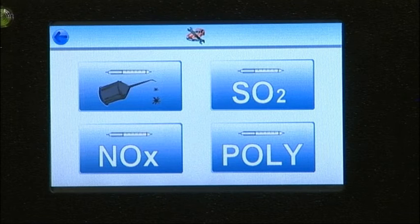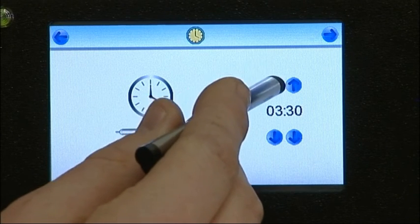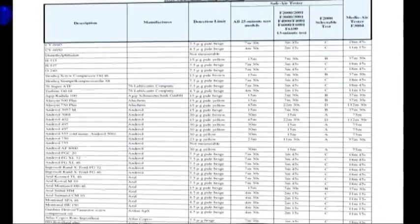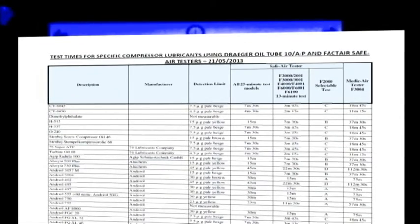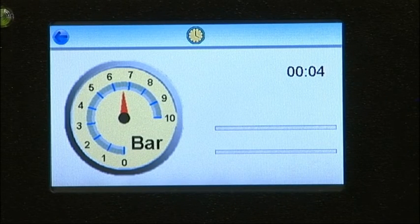If you're intending to complete an Oil Tube Test, you'll need to input the test time. If you can determine with a high degree of certainty the specific compressor lubricant being used, refer to the Test Times chart on Factair's website for the F6100. If you have no knowledge of the type of compressor lubricant being used, Factair recommends a 15-minute test as this covers the vast majority of lubricants. Once you've selected which tube you wish to test, the instrument will complete a 1-minute purge sequence, during which time an airflow will be passed through the port, clearing contaminants from previous tests and ensuring a representative sample is being tested.